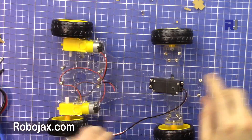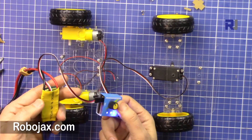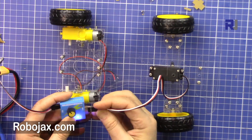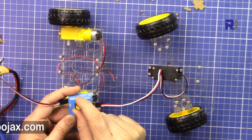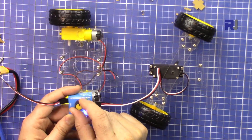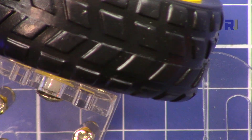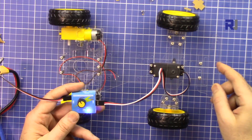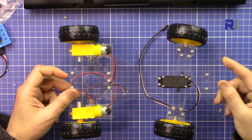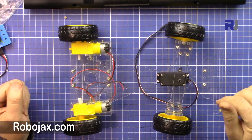The car is now fully assembled. Let me check to make sure the servo can rotate properly. I've connected the servo controller and an ESC providing 5 volts. When I rotate this, that's the maximum on this side. If I rotate it slowly to the other side, it's touching the tire - that's not good. To allow more rotation, this bumper should be removed or cut. The bumper is not a proper design. Thank you for watching - this was the assembly of the smart car kit frame. Please subscribe for updates on upcoming videos related to this and other robotics and Arduino projects.